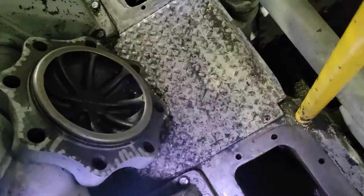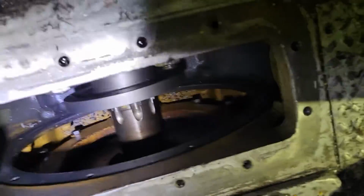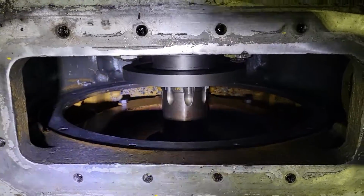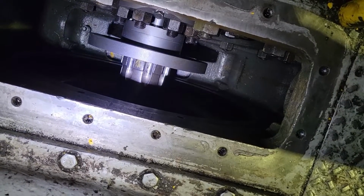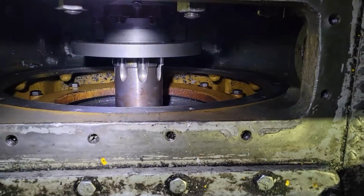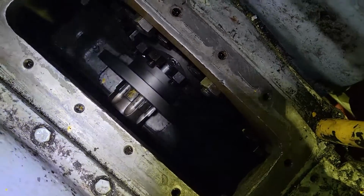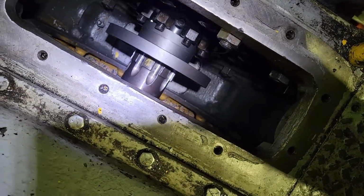That's the inside of a valve cap, the suction valve. Here's another one, the rod's in, piston's in. They've got the pressure packing done, that's on the one side, and that other part you're looking at is part of your inside head for your port, where your scavenging air piston is. We'll look at those a little bit more here in a minute.